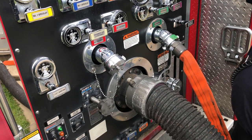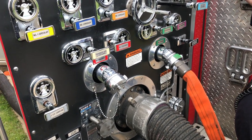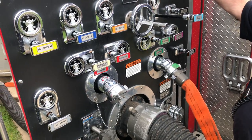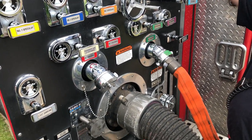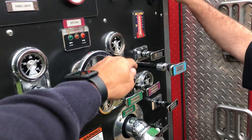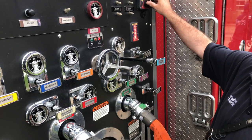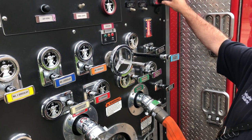Remember, this operation is dependent upon a flowing line. If you don't have water flowing from another engine or a hand line, you're going to have to create that. The way you create it is using your tank fill — your tank fill is essentially a hand line flowing off the engine. If you open up your tank fill, you can do the exact same thing. If you open it all the way during the changeover process, it's going to establish your draft for you.